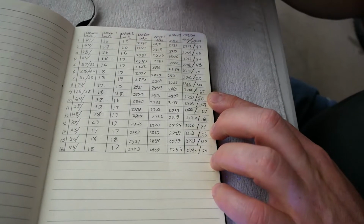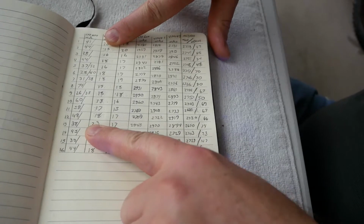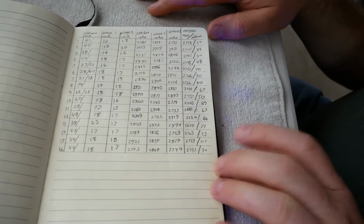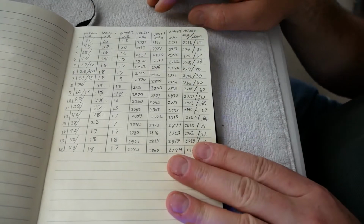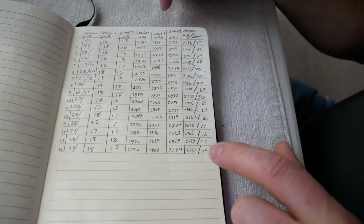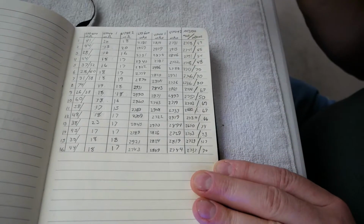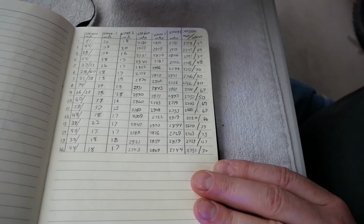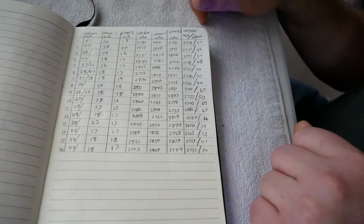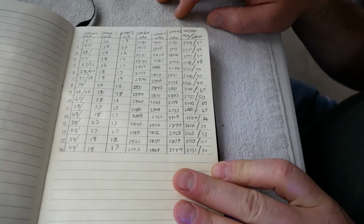However, if you look at the VP4 Plus 1 and the VP4 Plus 2, my lowest number is 15 milliohms, and my highest number is 23. So 7 milliohms different. And on top of that, the milliohm meter tests the cells nearly identically to the VP4 Pluses. So my confidence level as far as IR is concerned is pretty darn high for the VP4 Pluses, and sketchy at best for the relatively expensive Lee 600 and the definitely expensive MC3100. And it all comes down to how the contacts make up with the cells. And this was after spinning them around to make sure that I got clean contact. It still was much less consistent. So for IR, I would say I trust the VP4 Pluses, and I don't trust the Lee 600 or the MC3100, despite the MC3100 being a $100 cell tester.